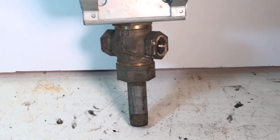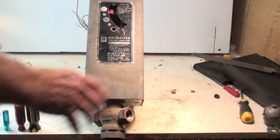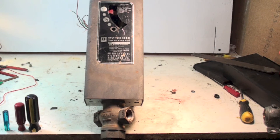So it's a three-way valve and a modulating control. Now this is a real freaking antique — this thing is out of the 50's probably. Anything that has the wrinkle finish on Honeywell and says Minneapolis Honeywell, you know is one antique son of a gun. This is built like a tank. Valves that we would use now that would do the same thing are just tiny compared to this thing.